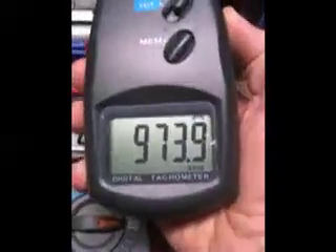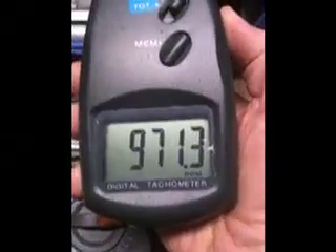This is a 20 microfarad capacitor attached to the AC side. I'm going to be hooking up a 560 microfarad DC cap. I have this machine running nominally at around 950 RPM or so. Just checking RPM — it's 973, 971, something like that.